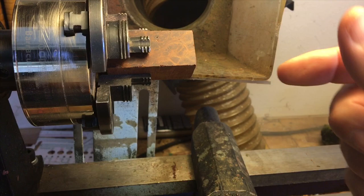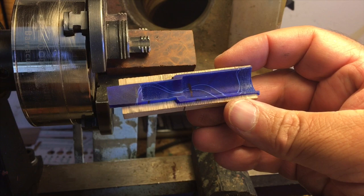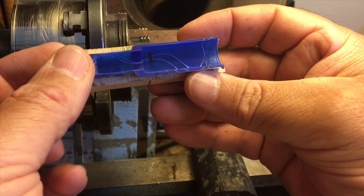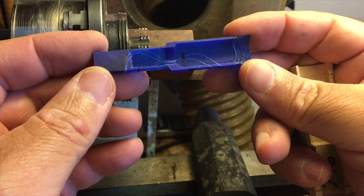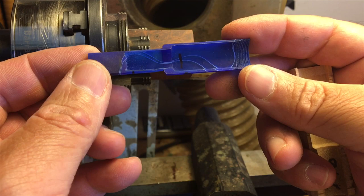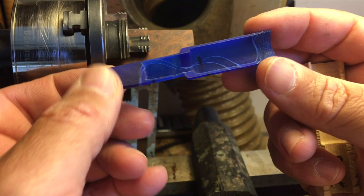In the lathe I have a piece of redwood burl. I have it faced on one side only so far. What we're going to do is something like this — this is for the cap. It's a first time for me doing a tapered cap that's sleeved from the outside. I've done tapered caps before but always with a solid body of the same material. In order to figure out the exact dimensions I needed, I made a prop, cut it in half, checked the wall thicknesses, and I'm pretty happy with it. It's much easier and cheaper starting out with a cheap $2 blank.